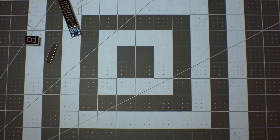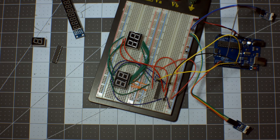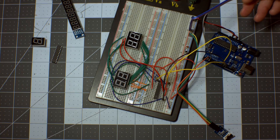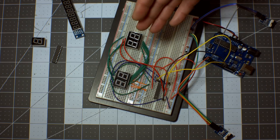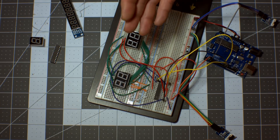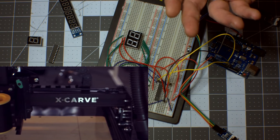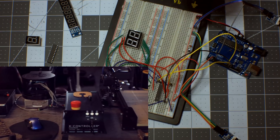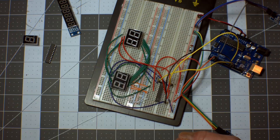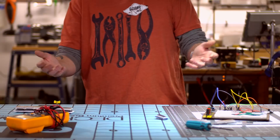What I'm going to do today is show you how to build a simple scoreboard. I've got two two-digit seven segment displays, the MAX7219 here, and two switches. When I click a switch it will increase the corresponding score. It's not complicated, it just requires a bunch of wires. In the next video I'm going to try to do my first PCB using my CNC machine, and this scoreboard project could be used for that.